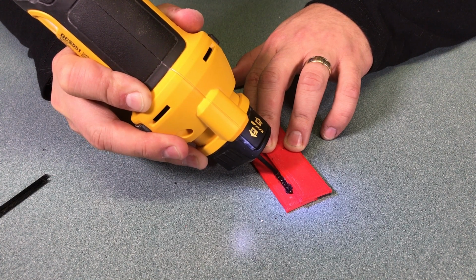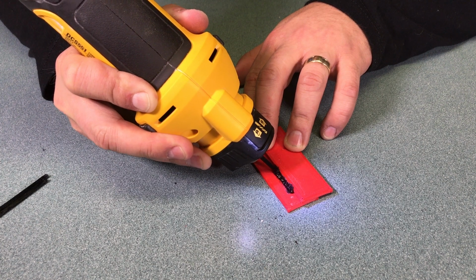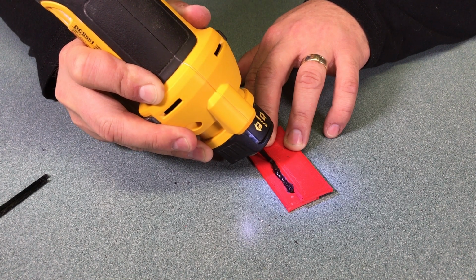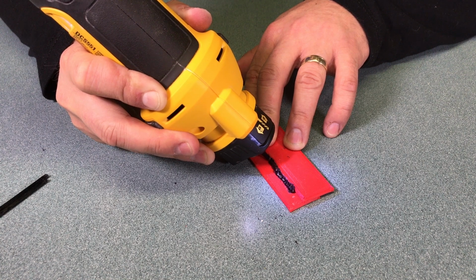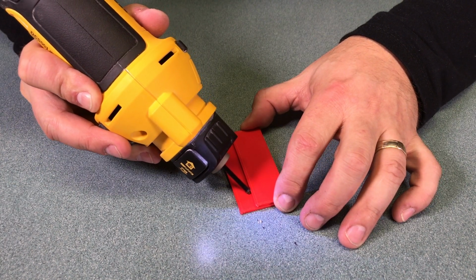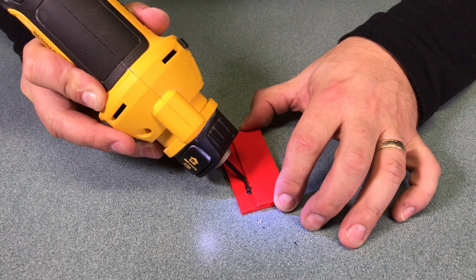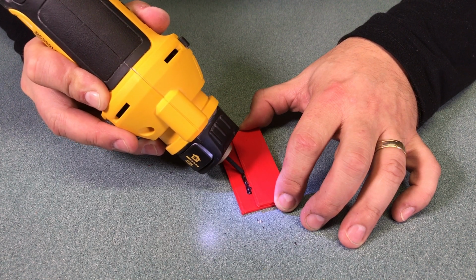You're really not using a very long piece of filament, or in my case the 3D printed welding rods, so you're not able to do that much of a stretch for each little piece, but you can probably get 2 or 3 inches in one pass as long as you go with steady progress. As you can see, each time I do it, I get a little bit better at it, a little bit smoother. So if you're trying this out on your own pieces, I would definitely give a few attempts to make sure that you're getting a good feel for what it takes to make a nice, consistent little plastic bead as you weld along.